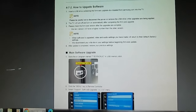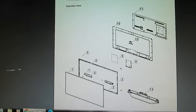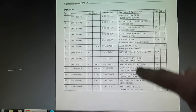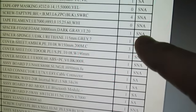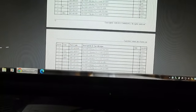What you're supposed to do is find the board the fault's on and replace the whole board. In a lot of tellies, a new board can cost more than the telly is actually worth. There's an exploded view and a parts list, and these are all boards — that's what the manufacturer wants you to replace. Looking further at the electrical parts, they all say 'SNA' — service not available — which means you can't replace them anyway. And when you get to the end of the manual, there's no circuit diagram whatsoever.